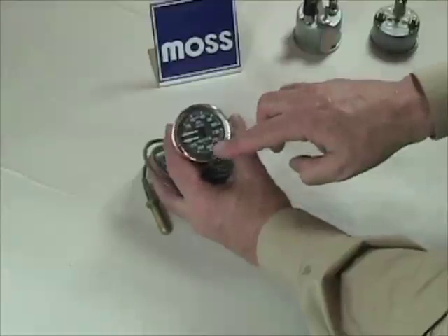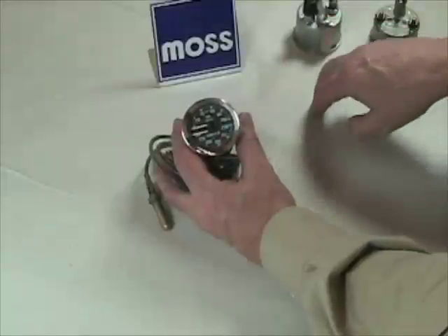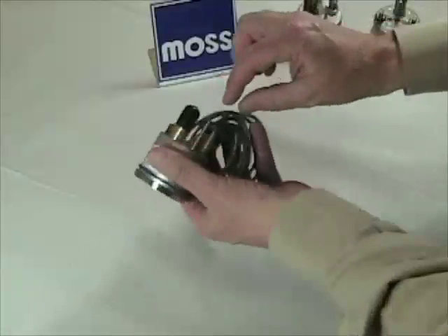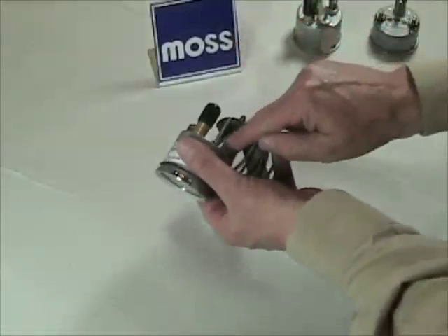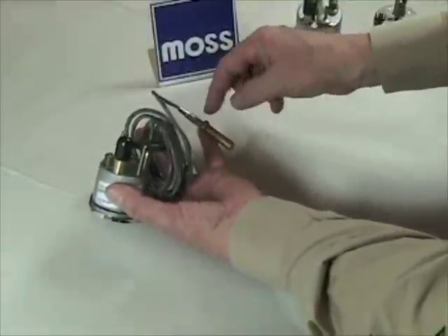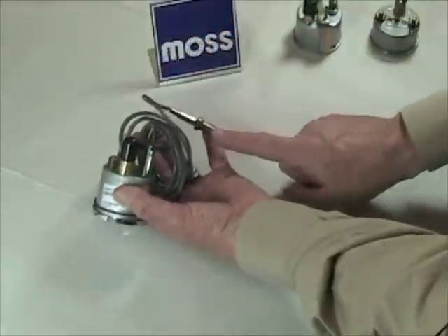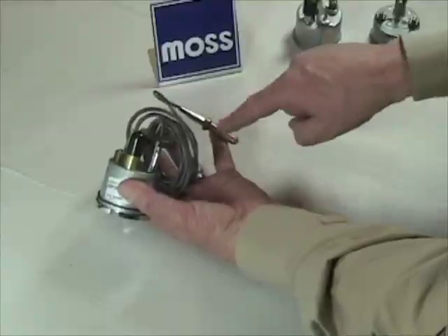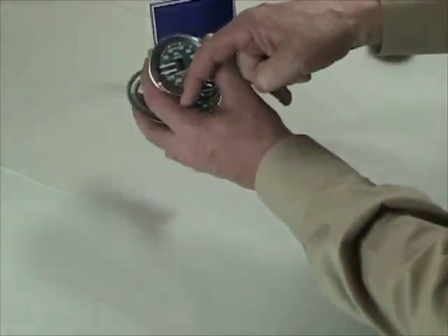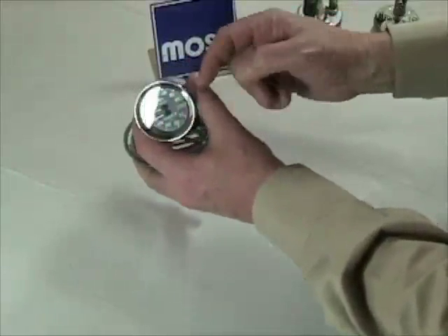The bottom is temperature, and interestingly it works the same way inside. But we're trying to measure temperature here, not pressure — so how do we get temperature from the motor to show up as pressure inside this gauge to move the arm? For the temperature side, there's what's referred to as a capillary tube. It's sealed and is part of the gauge from the factory. If you follow this capillary tube all the way to the end, you'll find a little bulb filled with something like ether or alcohol. This bulb is sealed into the engine with a nut right into the cooling system. As the coolant passes by and gets warmer, this bulb gets warmer; as it gets warmer, the product inside expands and creates pressure. The pressure travels through the line into the back of the gauge and the temperature gauge begins to move. As temperature gets higher, it expands more, pressure increases, and the gauge reads more. That's how these combination gauges work.